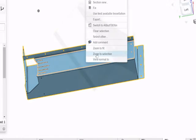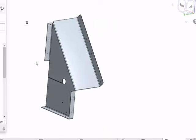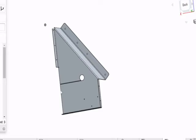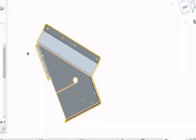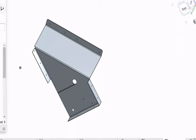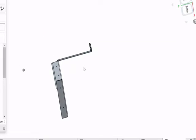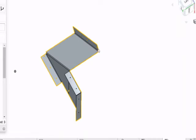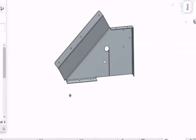This next piece is going to go near the far end underneath the muffler. Again, it'll be a flat piece. You can orient it by this hole and this cut line and slot in it. It has flanges around the edge. If you're looking at this face, there'll be a perforation line here — a flange on the left, a flange on the bottom, and a flange on the right down here. All of those are bent towards you, while this big rectangular piece here is bent over 90 degrees the other way. Then this flange along that edge is bent up 90 degrees. If you look at that part, you can see how to get that shape out of the flat piece.